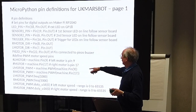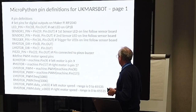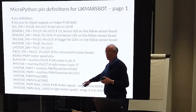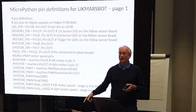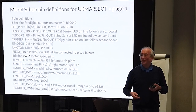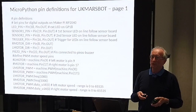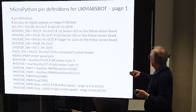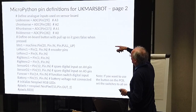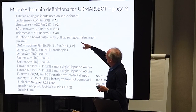You can set your PWM frequency down there. Note that your PWM range is not 0 to 255 as it is on the Arduino - it's 0 to 65535. There are a number of things like this: the ADC input values and PWM values have different ranges to what you'd use on the Arduino, but you soon get used to sorting those out. Then your analog inputs - telling you the pins for your analog inputs, side sense zeros, and your front sensors.